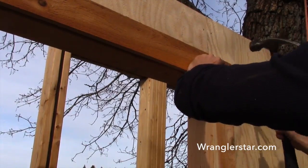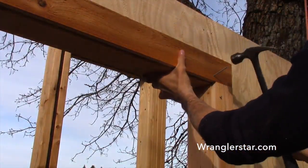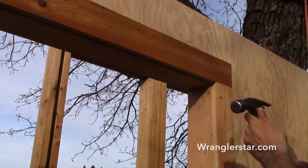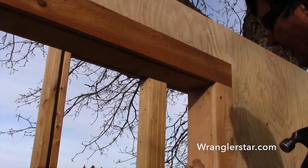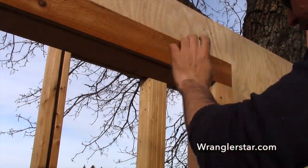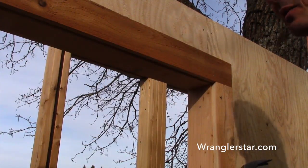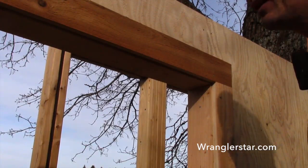Make sure we get into the stud here. Once we get this all on, we've got a nice 3/16ths reveal where we can put a tight bead of caulk to keep water out of the siding. Same on the top — it'll have a nice overhang over it, so we'll never have a problem. This is a quick and dirty way to do a window. There are nicer, more elegant ways with a ledge and a 10 to 15 degree bevel to keep water out, but it is a treehouse and you've got to stop somewhere — you can go crazy with this stuff.